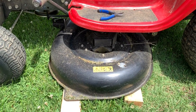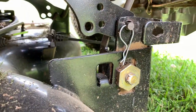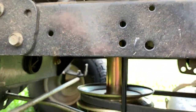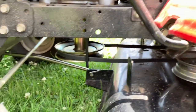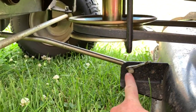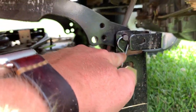I'm going to show you how to drop the mower deck on the Troy-Bilt Pony. There are a few pins you have to pull out — angled needle-nose pliers work great for that. Right here, remove this belt guard. That bolt takes a 13mm or half-inch socket. Remove the belt guard, then remove this pin so that bar drops down, which holds the front of the mower deck.